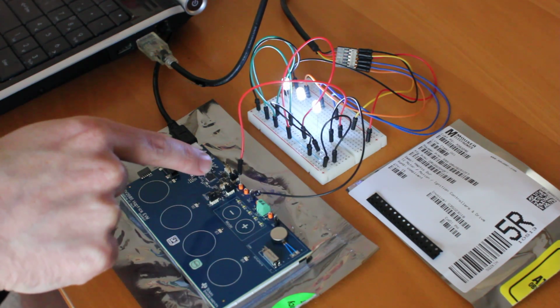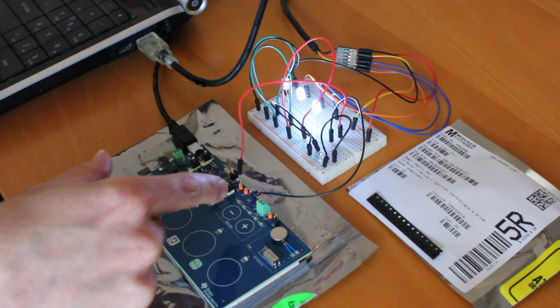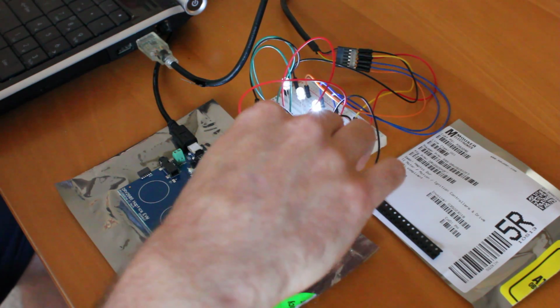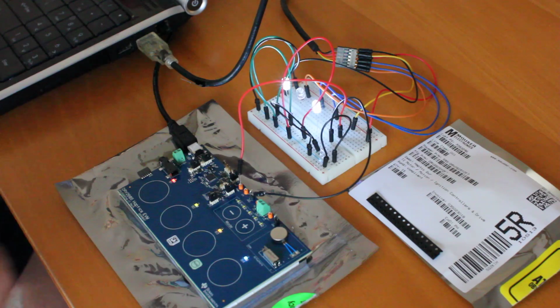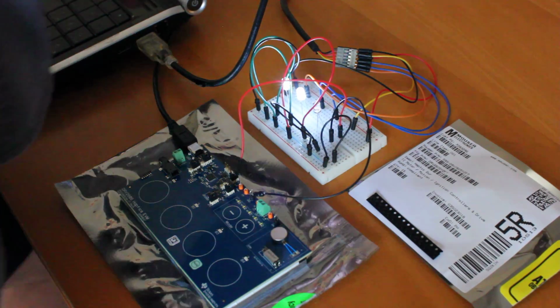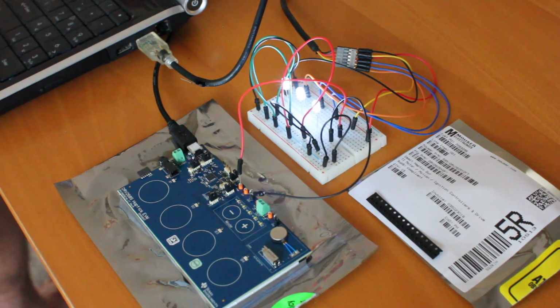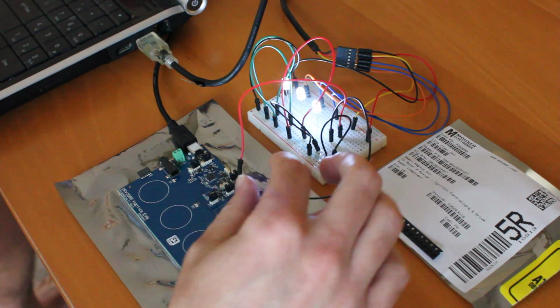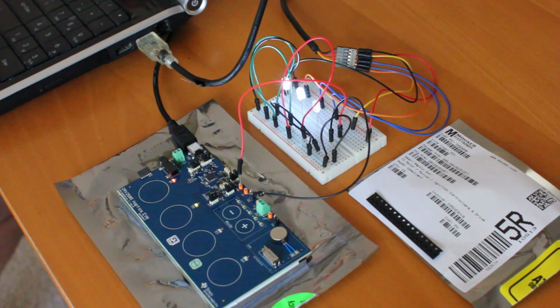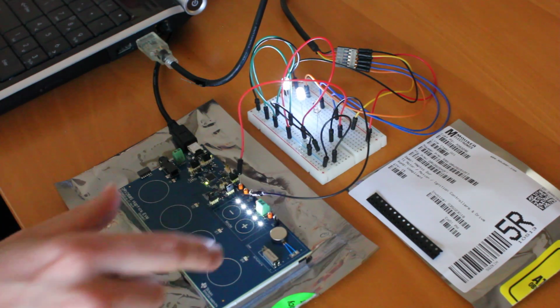So this is the TI Haptics evaluation kit, and it has PWM in, so you can control these motors. Let's see here. That's interesting. I'm getting power through the board from the PWM. Right now this USB cable coming in is only providing power. You're not controlling this from the computer. The control's coming through this PWM source. So I'm going to go ahead and plug it in, and you'll see it fire up here. Alright, it's running through diagnostics.